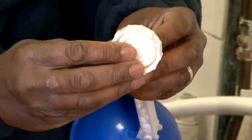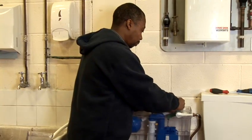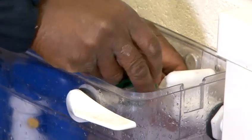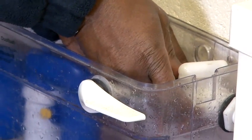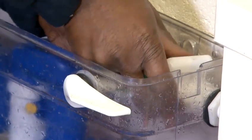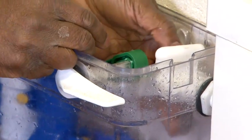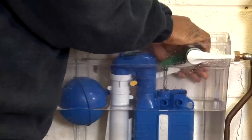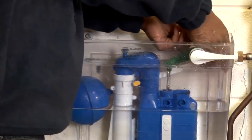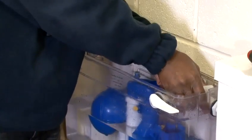Take the arm with the float and gently place it in the cistern, being careful that you don't drop the pin. Put it in position and gently run the nut up — it should run up quite freely without cross-threading. It goes all the way up, then just give it a gentle extra tighten. It only needs to be hand-tight.